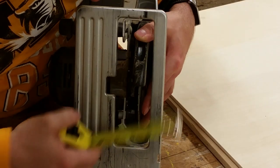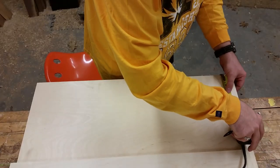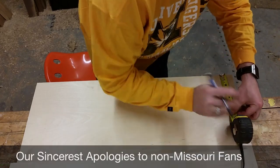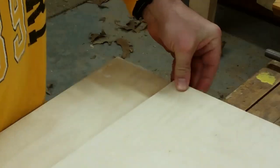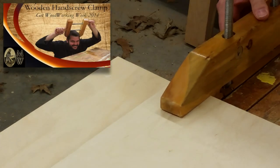The first thing that needs to be done is to measure the off-cut of your circular saw, which is the distance between the metal base and the blade itself. In my particular case, that's an inch and three-eighths. So I'm going to add that dimension every time I make a cut with the saw. For this plane, it's going to measure three inches tall, and so I'm marking on the half-inch plywood on each end four and three-eighths of an inch, keeping in mind the off-cut needed for the saw.